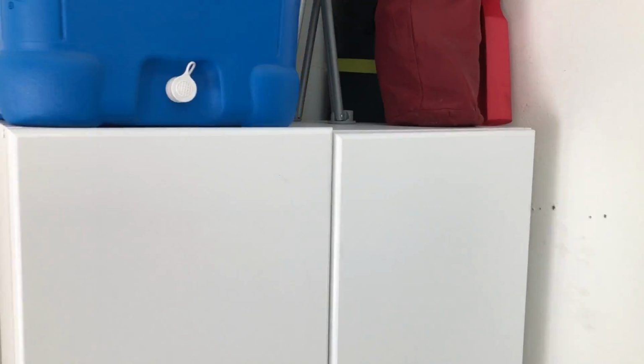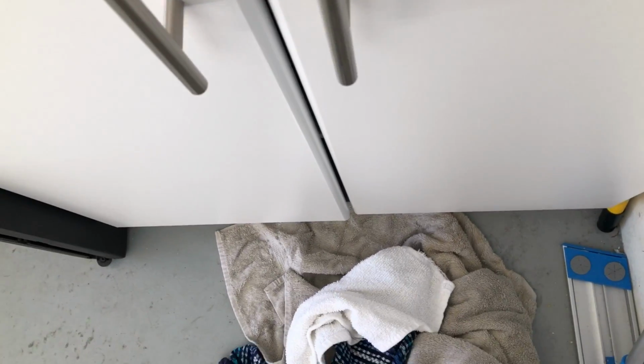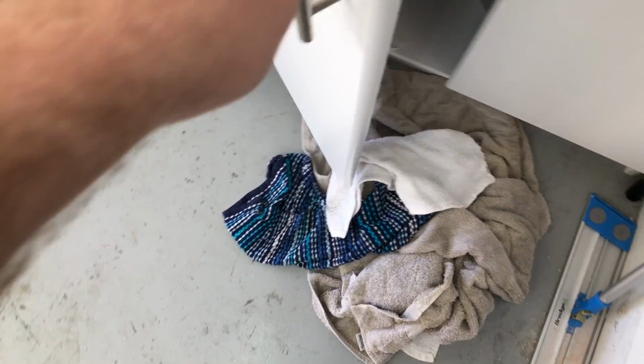This is not the fault of the door. That's the fault of the floor. It's got a slope to the corner. So I'll have to shim up the back left corner and that'll even the door out. The bottom, however, is the fault of the door. The whole piece of wood is warped. Kicks out at the bottom. Yeah, not really impressed with the cabinet.